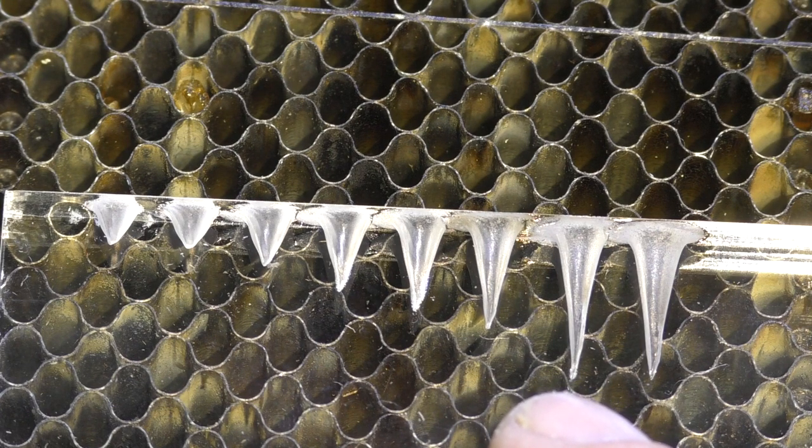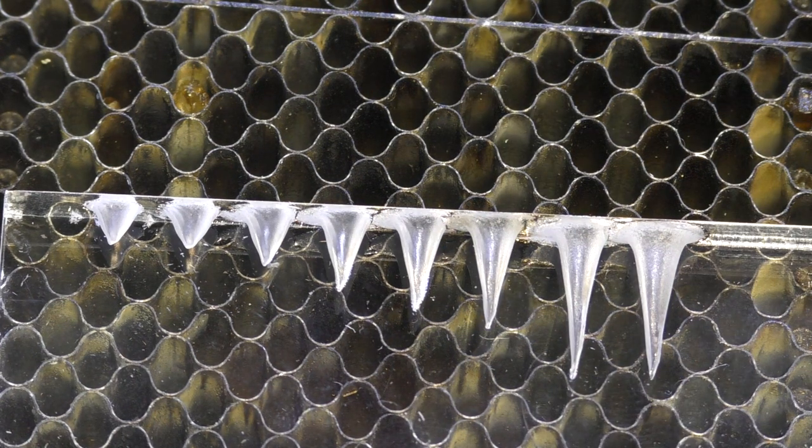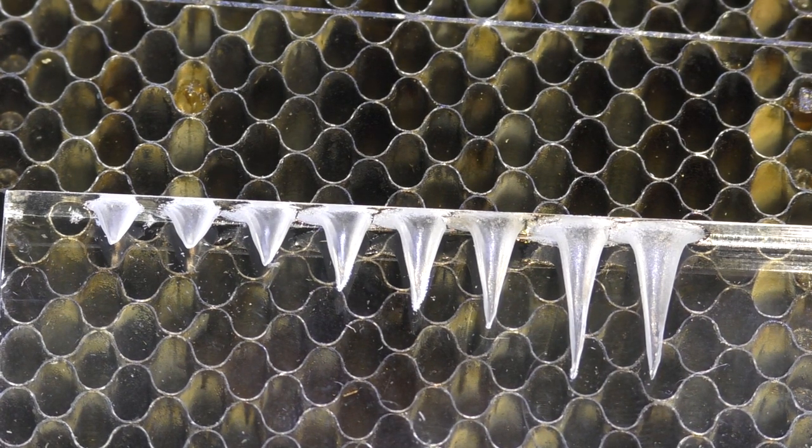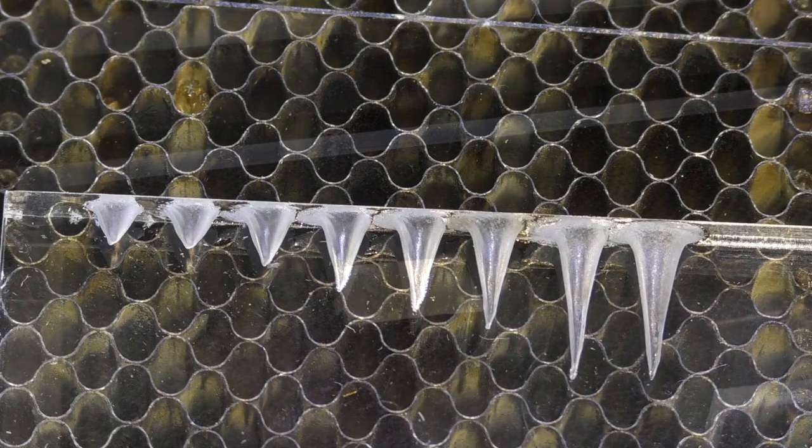and it's doing it with a very, very sharp point. This sharp point is nothing to do with the focus. It's all to do with the intensity of light in the beam itself. The more intense the light, the faster damage will occur in the material. That is a key mantra that you must not forget.